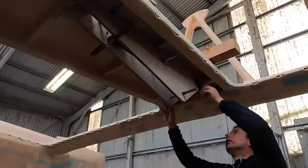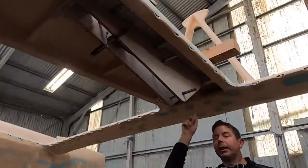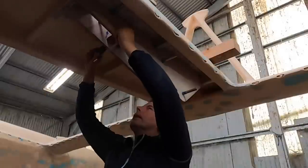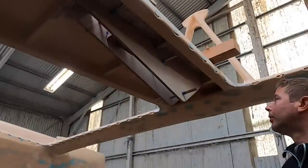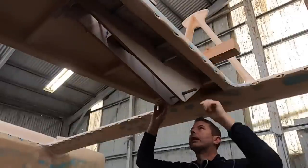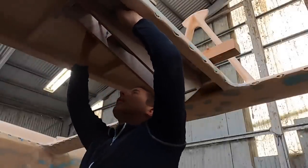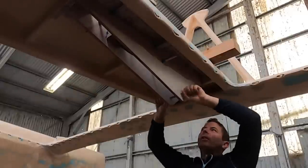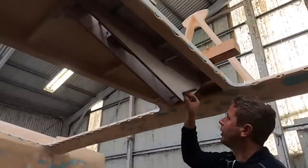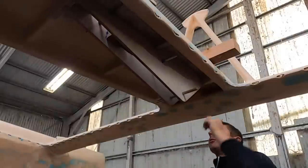Hopefully that thing stays up there when we remove the clamps now. During the day I'll clean up the cut in the catwalk and then I'll glass this whole piece in. These appear to be very much in line, and this one is very tight — it was very tight when I started, so it may just be a little bit off. That's gonna be perfect enough for sure. Hopefully I don't have epoxy all over bits that are not supposed to be glued to each other.